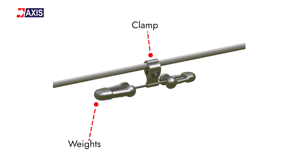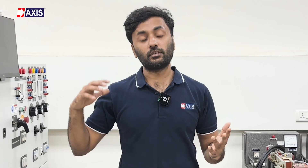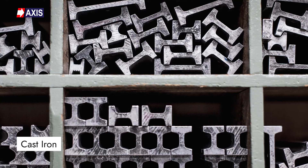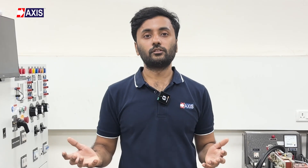Now let's discuss the materials used in manufacturing vibration dampers. A vibration damper has three main parts: the weights, the clamp, and the cable. First, cast iron, which is used for the weights. It is easy to shape into different sizes and doesn't rust quickly, so the dampers last longer. It is also hard to dent, helping dampers survive hits from flying objects, and it is heavy for its size, leading to strong dampers that aren't too big.